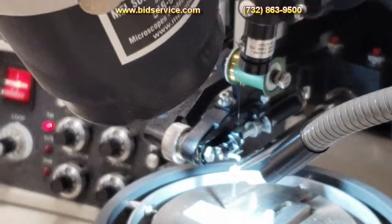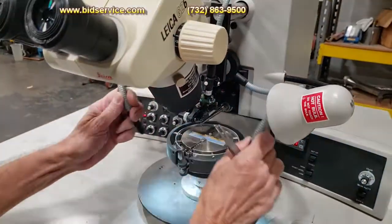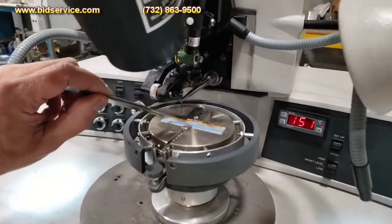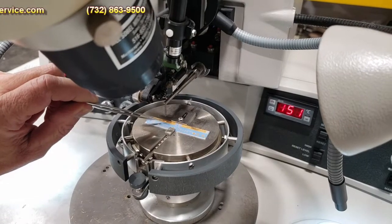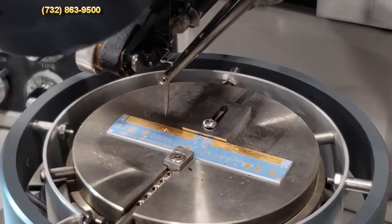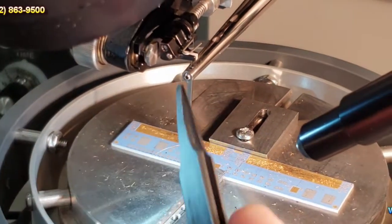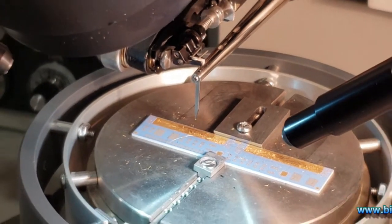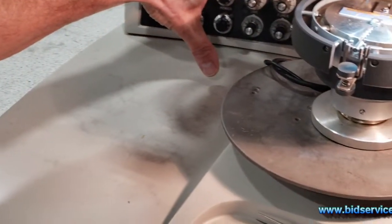Some of the options that come with this are the fiber optic lighting and a spotlight illuminator. What you do is make a bond and then place your crosshair — that white light and X — on your bond spot. You also have an area light if you need to feed the wire through the tool, and you can open and close the clamps with the one switch here on the left, right next to your light on/off switch.